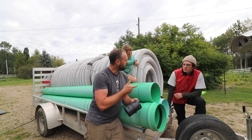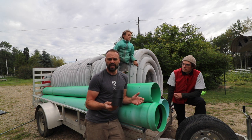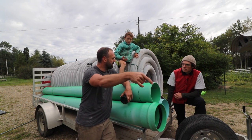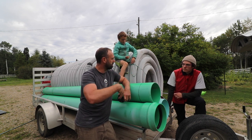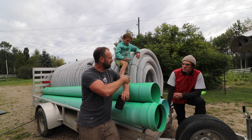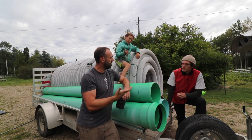Mitch is going to be writing a white paper on some of the findings, which will be coming out on our website in the future. There are actually a lot of learnings that came out of this. I thought these systems were diurnal — meaning they only stored energy from one day to the next, or day to night. But it turns out there's a seasonal effect. We're actually able to move energy from one quarter into another quarter. That's what the model showed. It's slow moving — slow in and slow out.